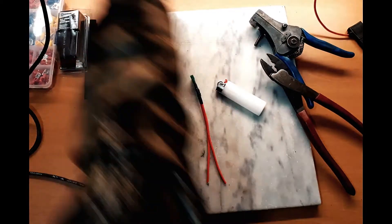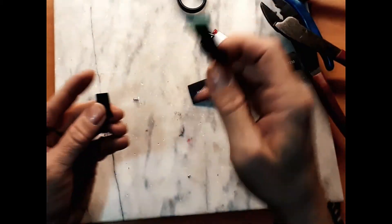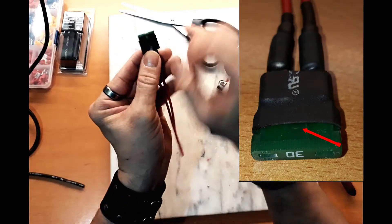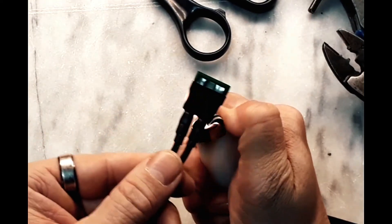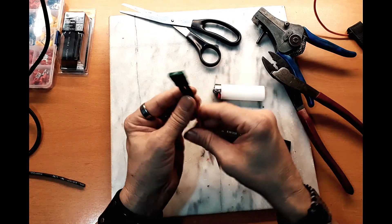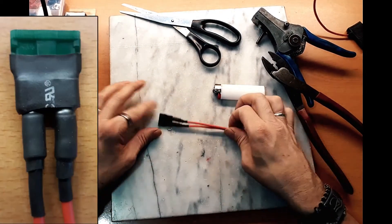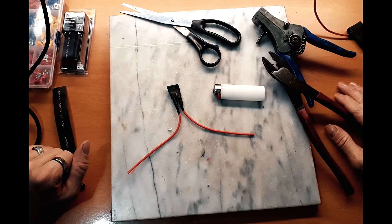The last thing I do that a lot of other people don't really do is I cut off a sizable chunk of the larger size heat shrink — I believe this is an inch size — and you slide it over top of the fuse. You can leave it so you can just see the top of the fuse filament, in case it's blown. This pretty much ensures that the fuse is not going to wiggle off, and it adds another degree of strain relief and some sort of moisture barrier if you're using it outside. And that is it in a nutshell — that is your basic inline do-it-yourself quick job fuse. Thanks for watching. If you found it useful, hit that like and subscribe, and until next time, take it easy.